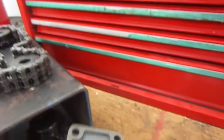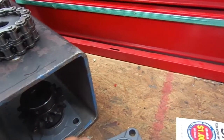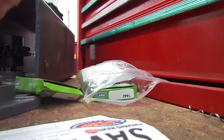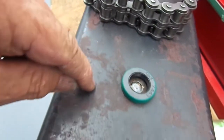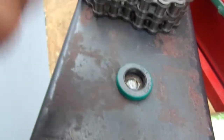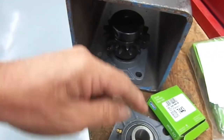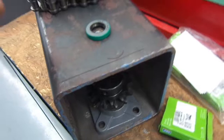These are bearings. I'm knocking these seals out. Take your grease fittings out and these seals out. Then I got these seals here. There's 3/4 in the middle, and I have a little piece of plate welded on here, round or square, for this seal to be inserted in it, so my shaft comes through. My shaft will have an O-ring groove in it, so it won't leak down the shaft. It won't leak out on this end. So that's kind of how we're going to do it.